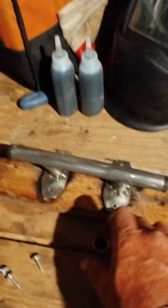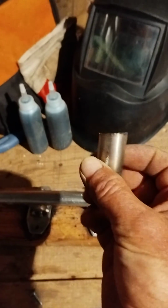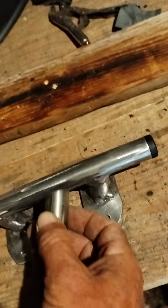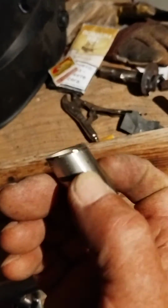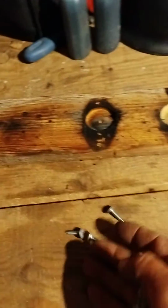The way I did it was, I took this piece of wood, so that's the angle of the cut, and then over here with a grinder I beveled it so it slides into this and comes halfway up. So I beveled this side and I beveled this side, okay? Then over the 2 holes, I screwed the 2 plates. I just screwed them down with these screws, okay?